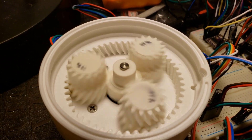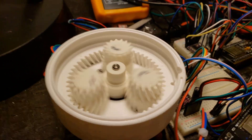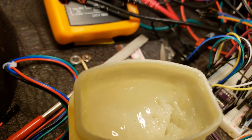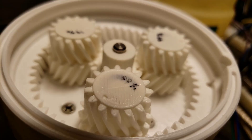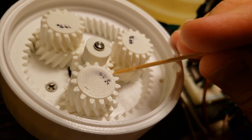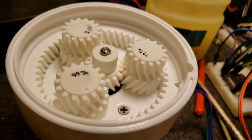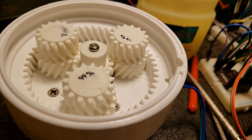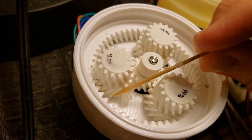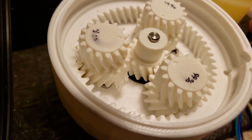Here I'm testing it. I've got it hooked up to an ESP32 with a DRV8825 stepper motor driver, running at about 24 volts. You do have to put some Vaseline onto the gears after you've broken them in to lubricate. You find that these run very smoothly — you can even tell in the audio the difference in the high-pitched sound when running without lubrication versus the much smoother operation after lubricating.